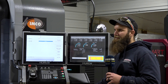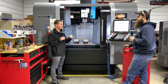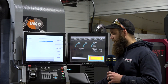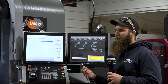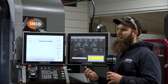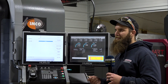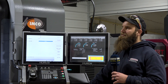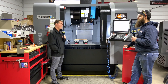With all the reshoring that's going on right now, maybe a great product to invest in. You mentioned this is for harder materials, but you also utilize them for some aluminums as well, right? Yeah, we utilize everything from the harder materials to — they have a coated three-flute series that we use a lot for aluminum that allows us to push the feeds. They also offer, if you need higher performance in aluminum and really want to crank it up, a five-flute for aluminum with a chip breaker, so you can really push your larger-diameter cutting tools and even up your feed rate.